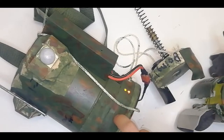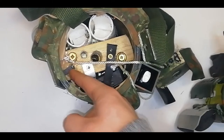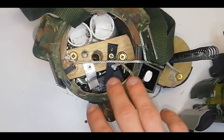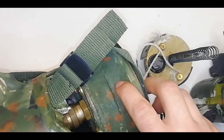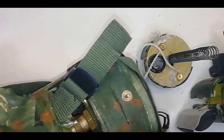So now the mine is armed. It won't fire now because there is another feature in the way — this reed switch here, which interacts with a magnet on the bottom of the grenade cup. This disconnects the firing mechanism from the relay, so that way you don't end up stalling the motor, because the motor will keep going if people keep walking past it. That way it disconnects it so you don't have to worry about burning the motor out or frying the electrics. And when you want to reset it, you push this button here which will wind back the motor, because it's a worm drive motor and you can't physically push it back. Then the collar should go all the way up.